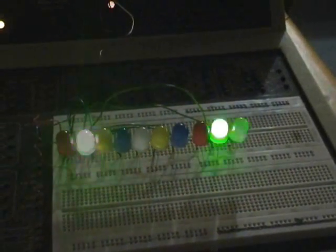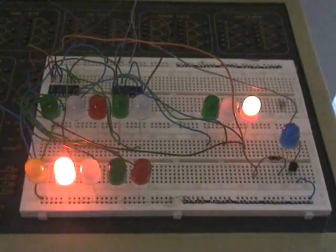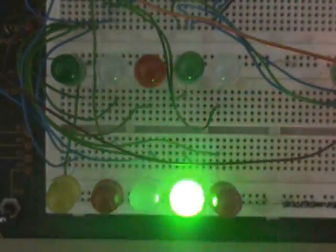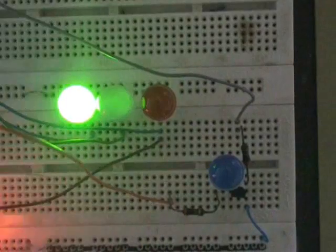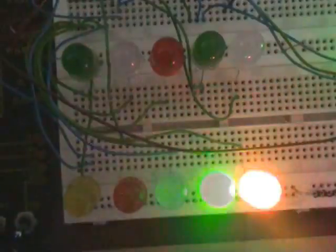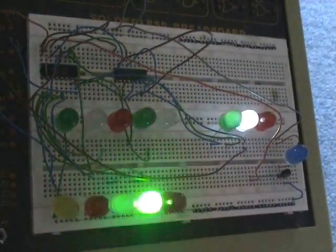Running at 10Hz impulse train — then decade. This is the unit's Johnson counter, the 4017 IC. The blue LED pulses every 30 impulses.